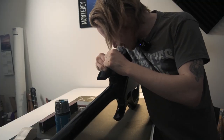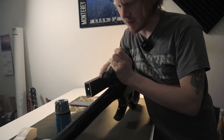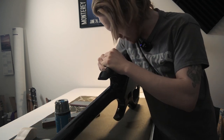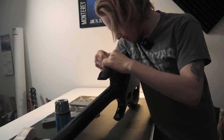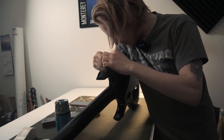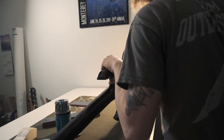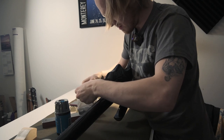It makes sense to do this now because we need to use a leveling beam to sand down the ends of the frets so they're flush with the fretboard edge. At the same time we might as well sand the ebony dust and glue level too.